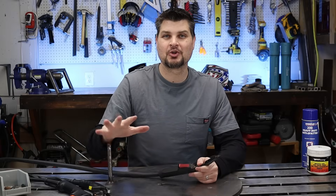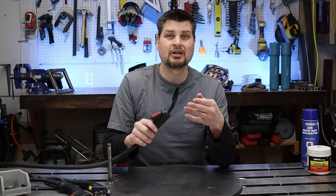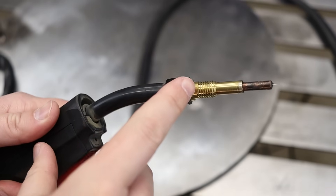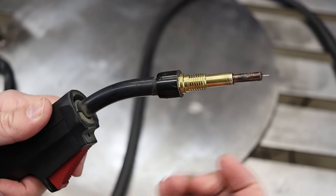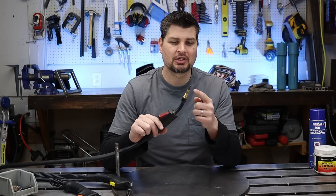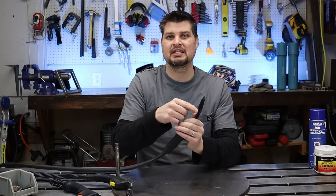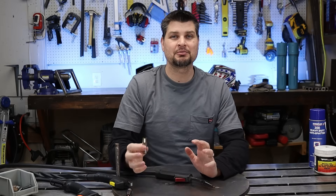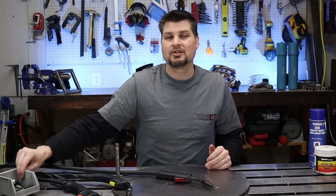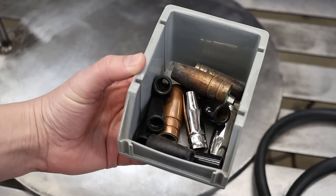Let's say you picked up a machine with no gas hookup and you can't change the polarity — in short, you've got a flux core only machine. Depending on the brand, you may even have a true flux core gun with no holes to even modify the machine to hook up gas. Even though those machines really could go without, I think just for aesthetics, more and more are adding a flux core nozzle — Titaniums, Lincolns have them. But if your machine did come with a MIG nozzle, yes, throw it out. You can throw it in your stockpile and have them sitting there forever until you do toss them.